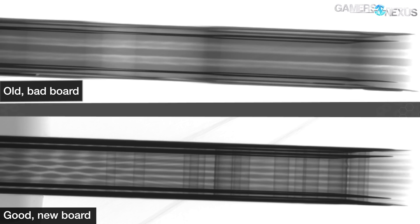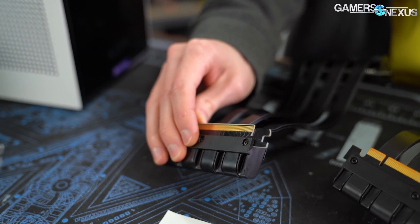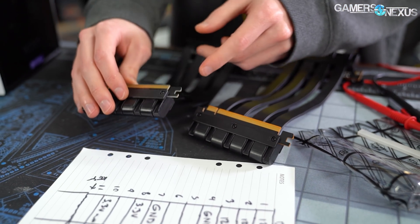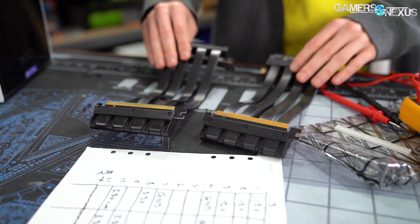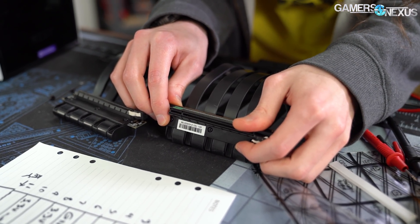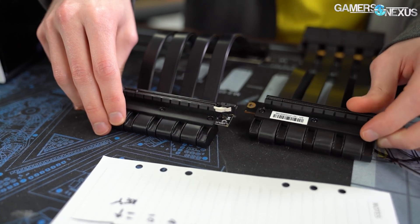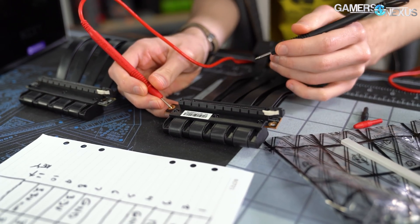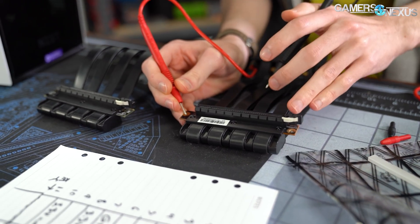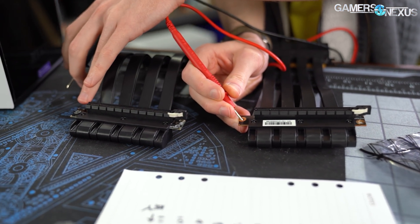I'm Patrick, and I'm going to do some continuity tests on the new cable, just like we did last time with the other two cables, to make sure things have been fixed. There have been some other changes — the PCB is a different color, which might be a coating or different material, but it's from the same brand. What matters, though, is the shorting-to-ground issue, so we'll test that now. The QC marker no longer has a year on it, but we can assume it was tested in 2021, marked two for February — so this is recent production. As Steve pointed out, there are far fewer holes in this PCB, and it seems purpose-built rather than reused.